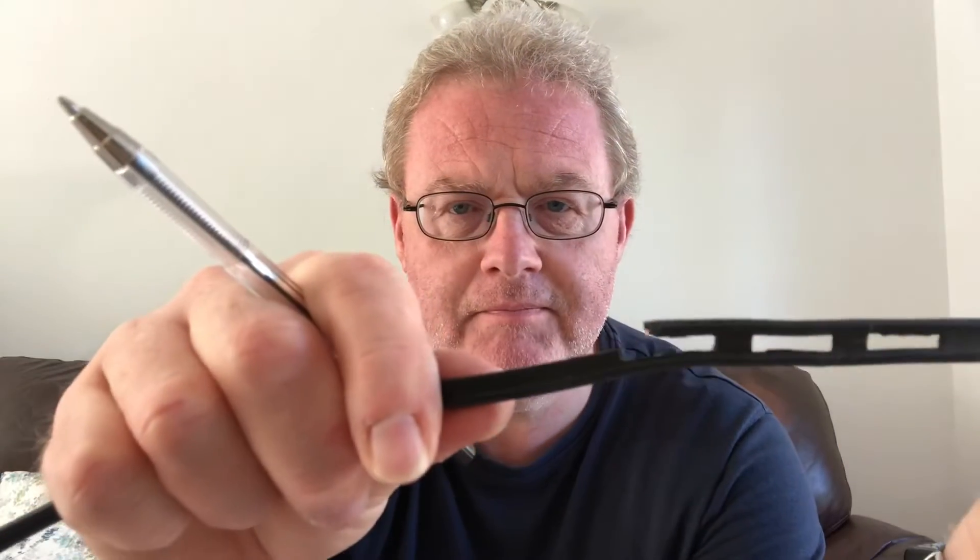So the aim is — let me give you an example, I've just started to do this already. Getting to the middle point, I'm going to strip just a little bit back. You've got two wires: one will be the 17 metre dipole and one will be the 10 metre. Strip back the insulation and put them both together into one ring connector, and that goes on to the balun. Then do the same on the other side. The 10 metre dipole ends there, and then the 17 metre dipole is the other wire, which continues on to the full length needed for 17 metres. We do the same on both sides, keeping them identical — they need to be identical to be a balanced antenna.